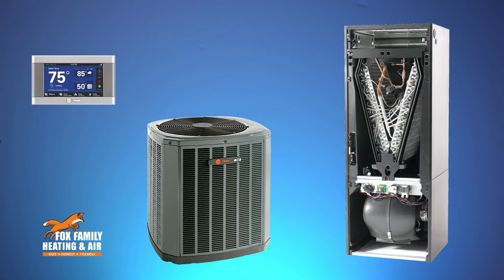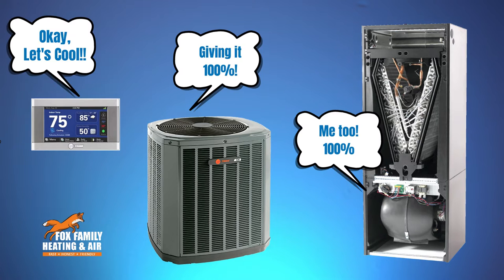Now, I'm going to get a little technical here, but I'll try and keep most of you with me. I always try to talk in the most basic terms so everyone understands. Let's learn about this with a simple single-stage system. On a call for cooling, a single-stage air conditioner and its indoor blower motor simultaneously turn on and begin cooling immediately at 100% speed or capacity. And yes, people do buy upgraded variable speed furnaces like the S9V2 furnace to match their standard single-stage outdoor condenser.